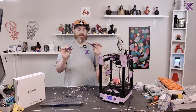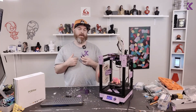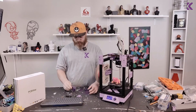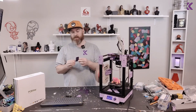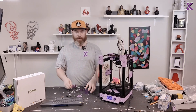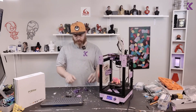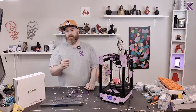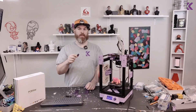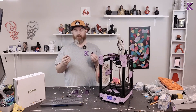Here are my new CNC parts. The finish is excellent, and except for the mistakes that I made when I designed them, they are pretty much perfect. I've already test fitted one to make sure it worked for the video. I did make some mistakes when I modeled these — I made some holes too small, so I need to just drill them out a little bit. I'll fix these before I eventually upload them. I did not include threads in the model simply because that cuts cost by a lot — I think it's around 10 bucks per piece — so threading these yourself is definitely the way to go.